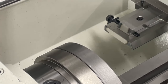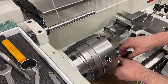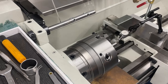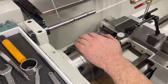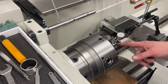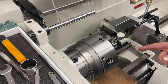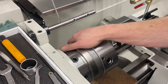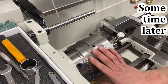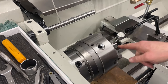I've got a little more variation than I'd like. Since this is unsecured, maybe I should just put the chuck on, tighten it all up, and then see what runout I've got. So I've now got about a thou runout back here, hardly any there - which means the pin is causing this. I wonder if I can balance that out. The answer is no, I can't. That face needs to get trued up in order for this to run true. So that's what happens next.